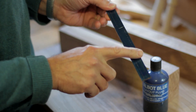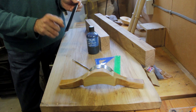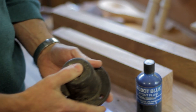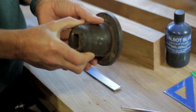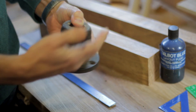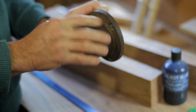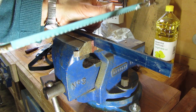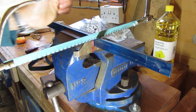Then it's really just cutting it out, and then filing or grinding off the bevel — the bevel will go on the inside. The next stage after that will be the forging, which will be to actually make the curvature. Ideally for the forging one has an anvil; at the moment I haven't got one, I'm in the process of acquiring one. But I have got this very heavy bit of iron which I'm going to hammer around — it's the right sort of curvature and shape for what I want, so held in a vice it'll do the job quite well. I've got my metal all marked up and I've just started doing the cutting out.